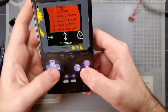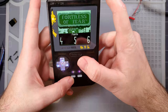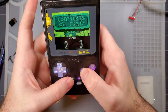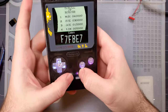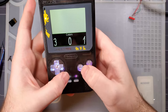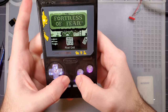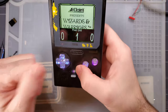I do need to adjust the V position just a hair — things got shifted around with the new firmware. My screen is crooked, so I guess I do have to pull it apart again. So you get the same adjustments: H position, V position, we can change the palette — that's what this touch sensor does, but it doesn't do anything when you're in the OSD. You can of course hard code any palettes you want during firmware compilation, but the defaults that KGSWS provided are actually very reasonable. Even if you don't like them, you can go in and edit them anyway — even after it's compiled, you can make your own custom color palettes. You have the four colors: black, dark gray, light gray, and white, with a full hex code for each. Pixel grid is the exact same option as before, with only the two options, because that's all this kit was ever programmed with from the original manufacturer.